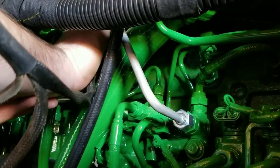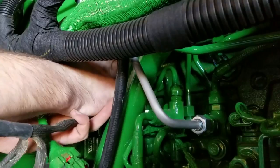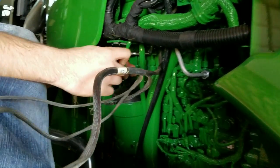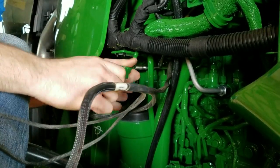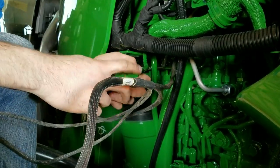A flashlight also helps to see where you're at. There we go, we're in line. You heard it click — make sure all your connection points always latch. We'll go ahead and take the female engine harness and plug in the male portion on our harness. As you can see that red locking tab is here — once that's latched, go ahead and put that in to secure it and keep it from coming loose.